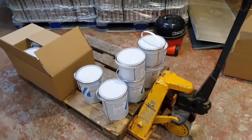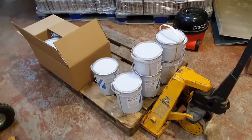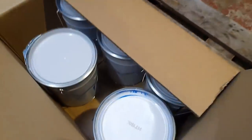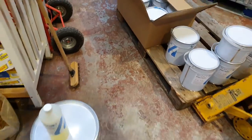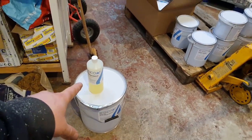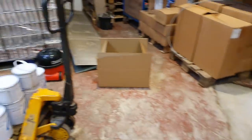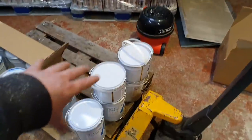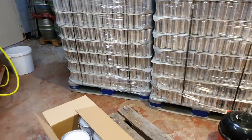So what's happening inside today? Well, the floor is drying off nicely and we've had some epoxy floor ingredients delivered. That's the colour we're going for for the main brewery floor — blue. We've got some rapid set epoxy repair mortar for doing all those joints, and we've got all these tins here which are the epoxy primer that goes down onto concrete after we've prepared it.